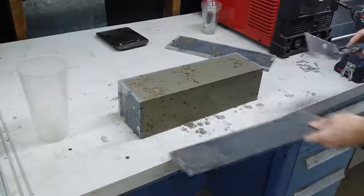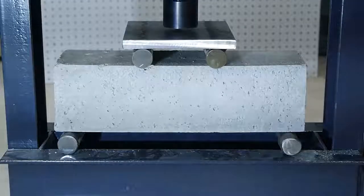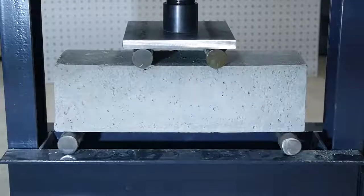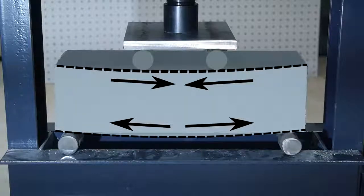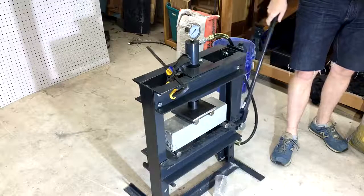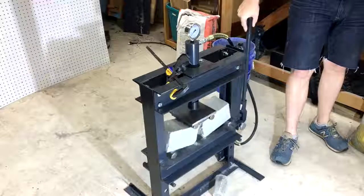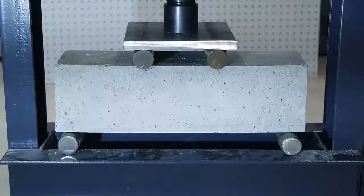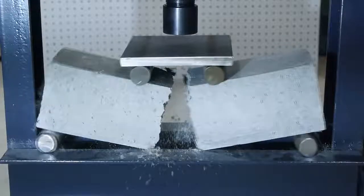This particular classic beam is homemade by me out of pure concrete here in my garage. Applying a force on this beam causes internal stresses to develop. The top of the beam experiences compressive stress and the bottom of the beam experiences tensile stress. You can probably guess where the failure is going to occur — it happens almost instantly, and you can see that the crack forms on the bottom of the beam where tensile stress is highest and propagates upward until the beam fails.